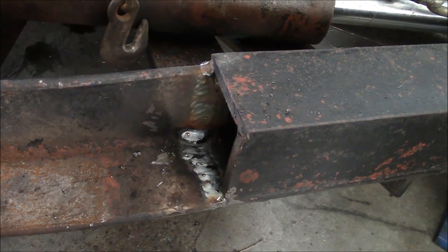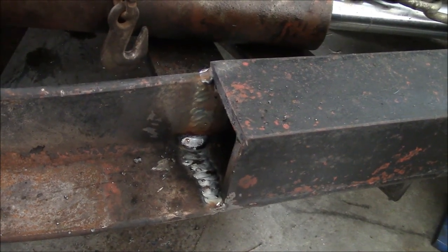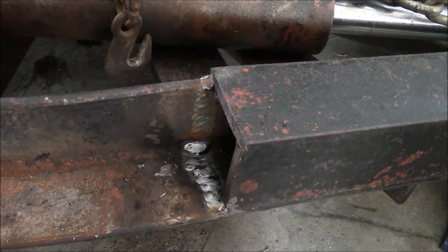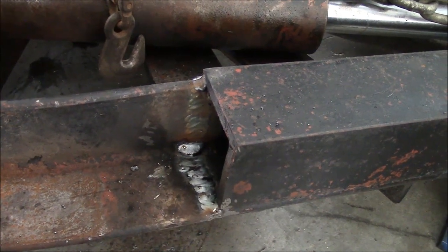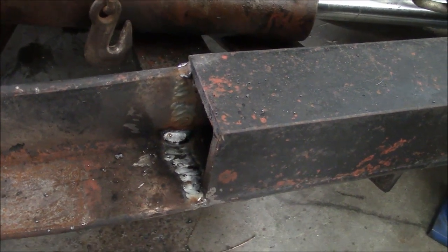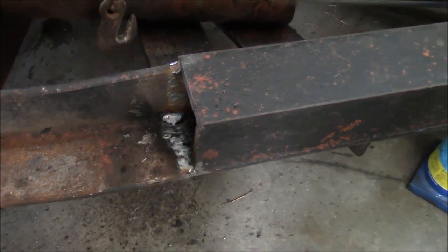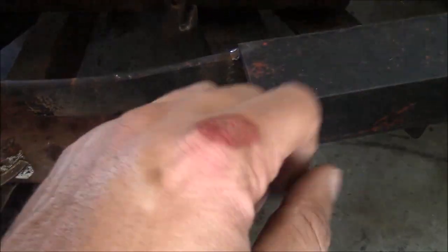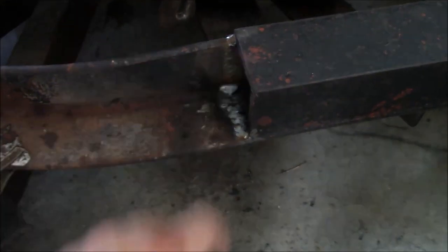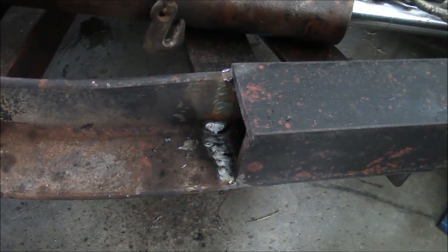Okay, doesn't look too bad. It's a little bit too big of a project for my little Miller-Matic — I probably should have grabbed a bigger welder. But two passes, I think it'll be just fine. I did a root pass and a stringer or top pass, and I welded it on the back and the bottom side. I won't make you guys watch me weld overhead out of position — we'll try to keep the video family-friendly. I know I got it good and hot because that doesn't hurt right now, but I bet it will later.